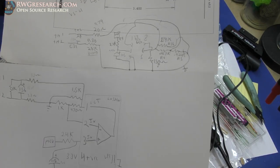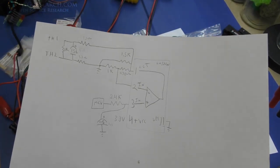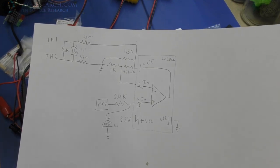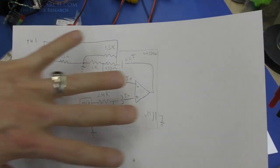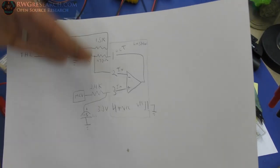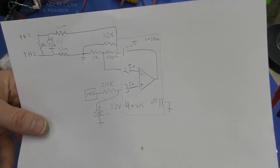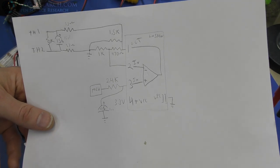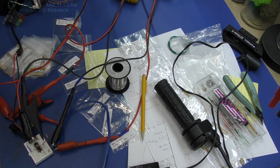The op amp is different. I actually can drive this right about the same voltage, and I'll get maximum or close to maximum output. So that's interesting to me. So I'm guessing that I could actually do the same thing. Now, right now I have the software set up to deliver a full maximum output. I'm going to go back and recalibrate that slightly and just rescale what I'm about to show you with the software. So that's the circuit.